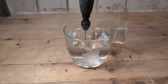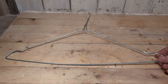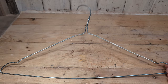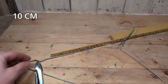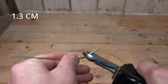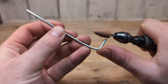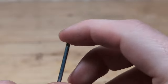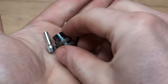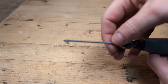Next up we have a mixer that you can make from steel wire. This can be used to mix liquids. The steel wire from coat hangers is perfect for this bit — they are stiff but thin enough to fit into the collet of a rotary tool. Get some pliers and cut off a straight four inch piece of wire from the coat hanger. Then bend a half inch 90 degree angle at the end of the wire to make it into an L shape, and grind down the sharp edges for safety. Find the right size collet to secure the wire in the chuck of your Dremel — in this case I had to use the multi chuck. Now the mixer is ready.